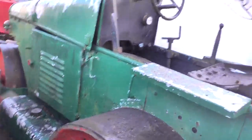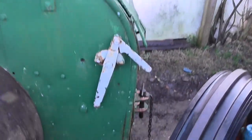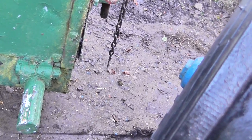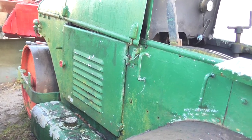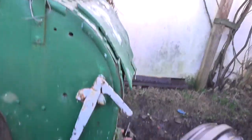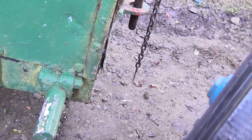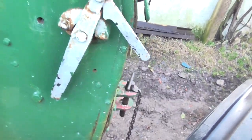I'm trying to find the history on this one. Another interesting thing is that device there — you can fit the starting handle on it. It moves a counterweight which goes between the two rolls on a sled, like a bogey on two rails. You can actually distribute the weight from the front to the rear of the machine by winding the start handle — it's like a wire rope on a pulley on a sled. Genius idea.